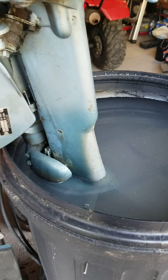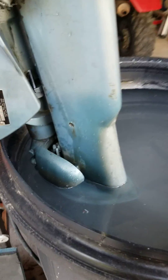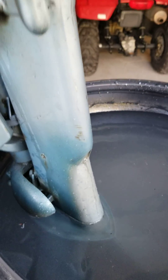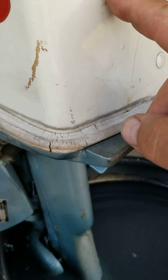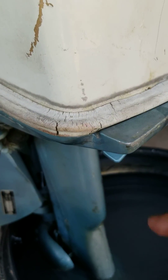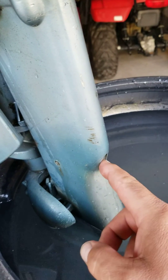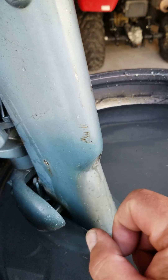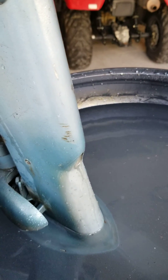We're going to get on that lake and see if we can't get some of them perch. But just make sure you have water coming out of here because you do have a thermostat up in the top. And sometimes the thermostat sticks. But as long as you've got water coming out of here, that means your impeller is working good. I actually pulled it apart to verify that it was not tore up or whatever.